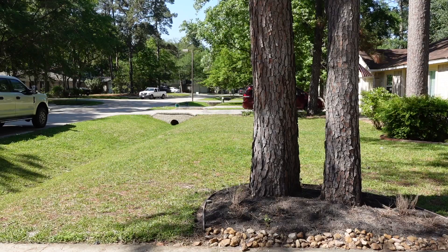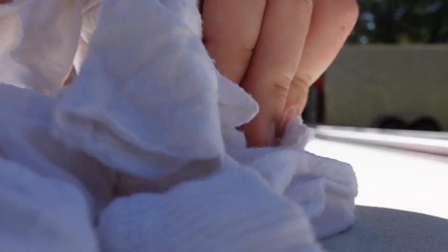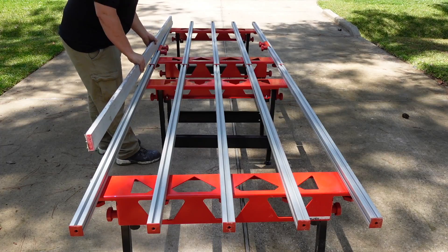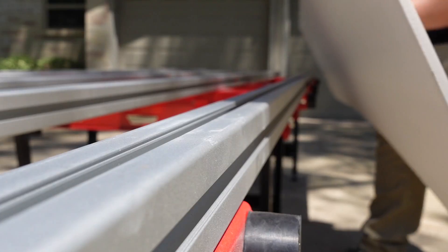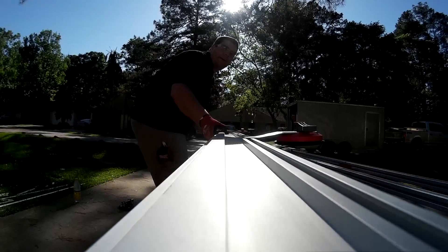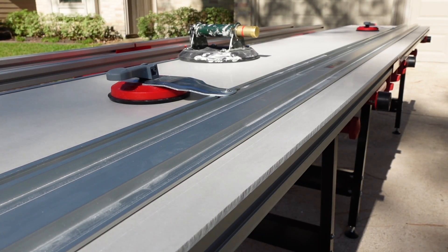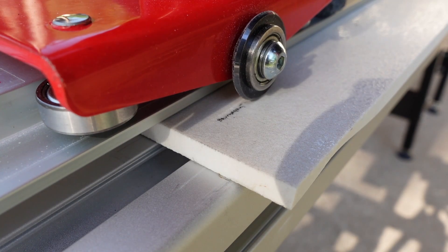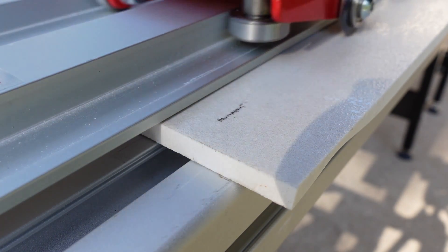For maintenance on the guides, you really just need a dry rag — wipe down any dust or particles. Now that you have a clean guide system assembled, make sure you have a table with tolerance for flatness, then put a piece of porcelain on the table to be cut. Mark your cuts and line up your guide. The guide should offset roughly three-eighths of an inch from the track to the cutting blade. I would suggest lining up and checking both sides of your cut before clamping the suction cups down.